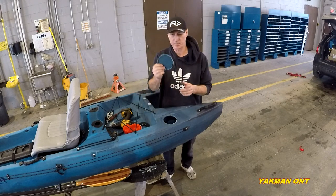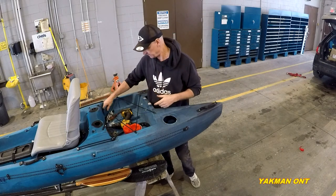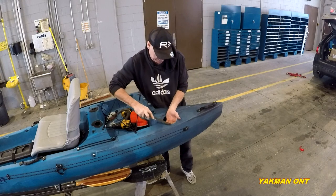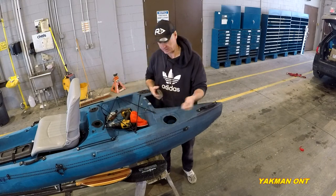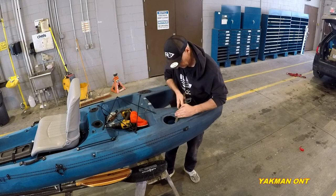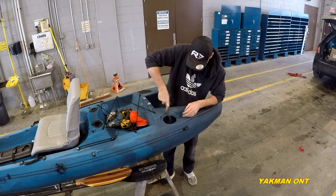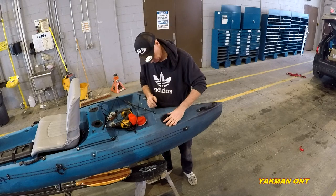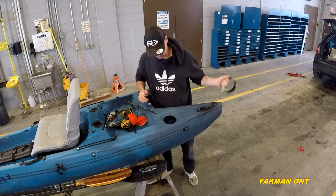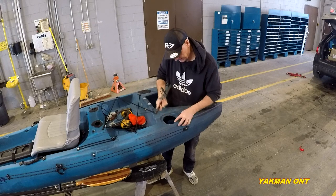Always save that cutout — if you get a crack somewhere, you can warm the two surfaces up and reweld the cracks. It's the same material so they'll bond very well together. Scrape the edge because when you cut plastic it kind of melts, so it sticks. Now I'll quickly check — spot on, dead on, nice. I just want to get this nice and clean so it sits flat.